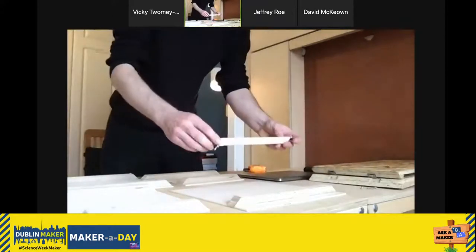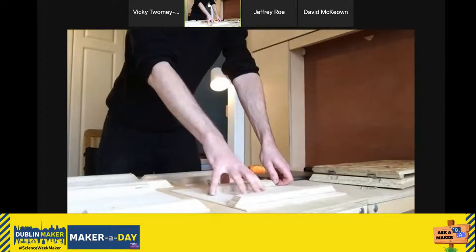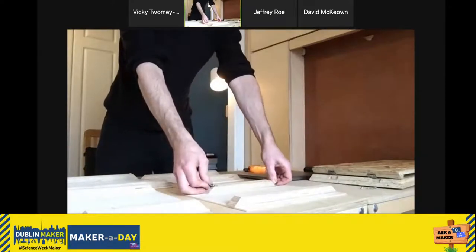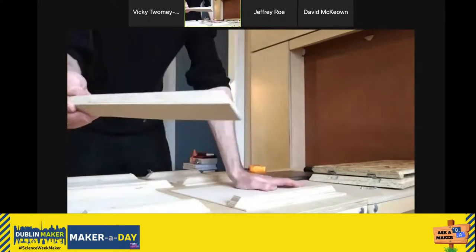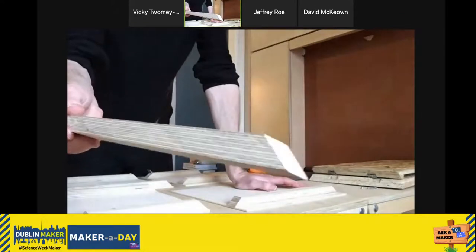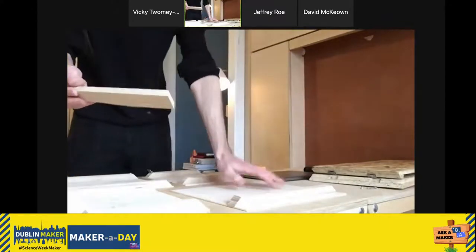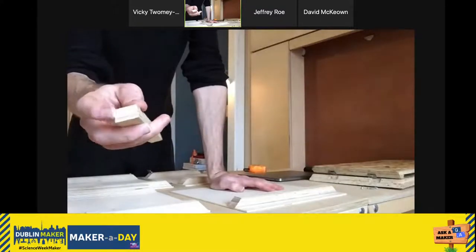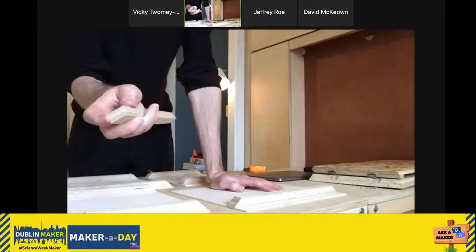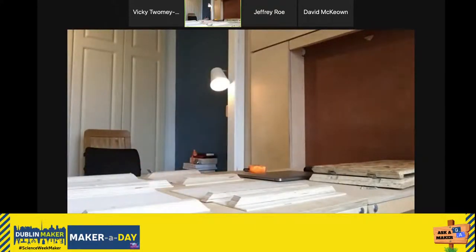And we do that beforehand so that when we're gluing it down, we can glue it down flush to the actual sheet of material that we want as the wall. So these are actually made out of plywood, 18 mil plywood. I had this lying around because I've already built the cabinetry for the bed. So I cut it down to size and cut it with a miter edge again. And we'll talk a bit more about the miter edge in a minute as well. But the miter edge and the actual plywood comes from a strip of wood that I had left over here.